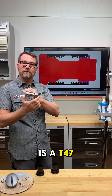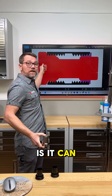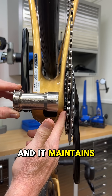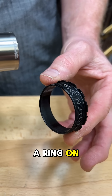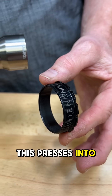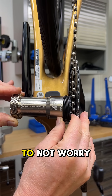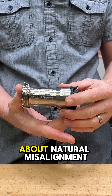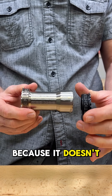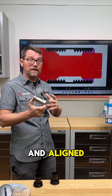Our solution is a T47 one-piece hub-style bottom bracket. What this does is it can go completely through the frame and it maintains perfect bearing alignment because it's a hub. We have a ring on one side that this presses into, represented by the purple right here. What this allows is for us to not worry about what the frame is doing, not worry about natural misalignment of threads, because it doesn't matter to the bearings — they are completely contained within here and aligned.